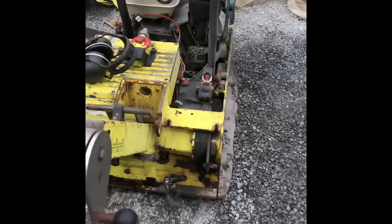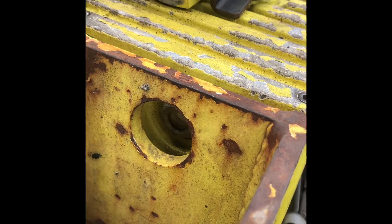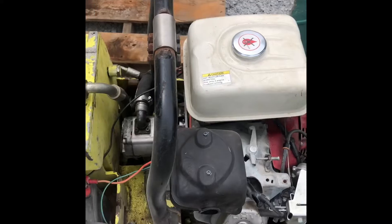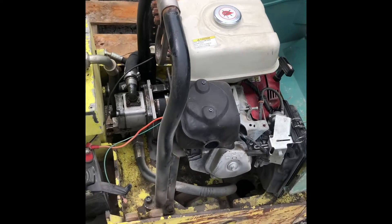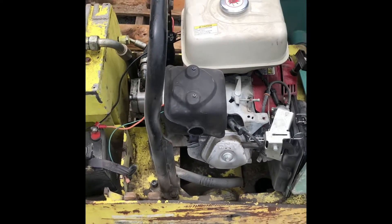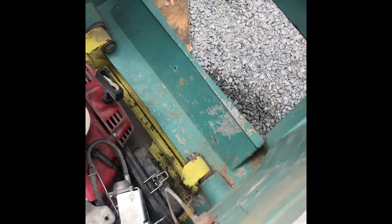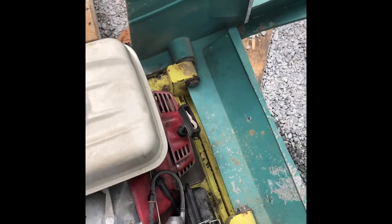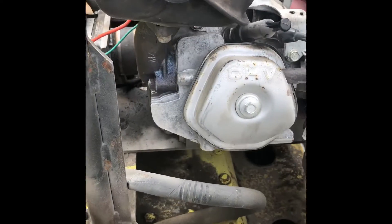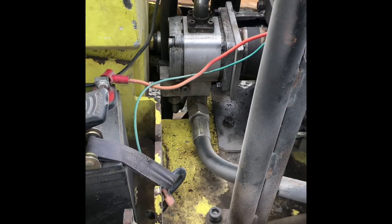I was thinking of not doing the electric start before, but when it's direct drive like this it's got to be hooked up to that battery to get it started. It seemed to be a little troublesome to start, but maybe it's just because it hasn't run in a while. Pretty tight clearance over in the corner here - had to notch that so the air filter could come out. We're going to have to raise it off the base a little bit, maybe an inch, so we can get that air box off and have it actually accessible.